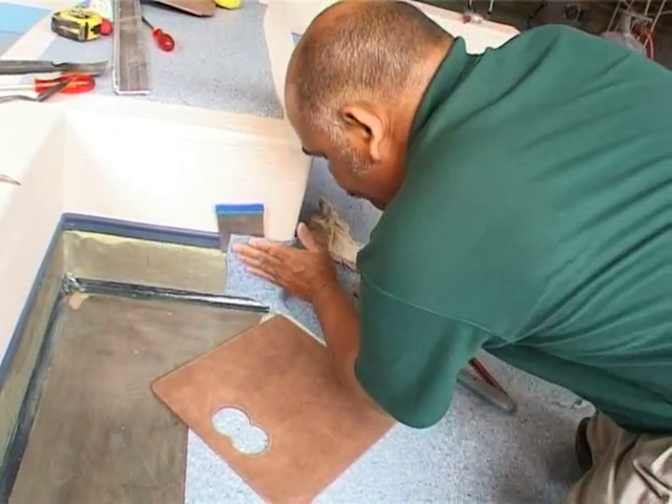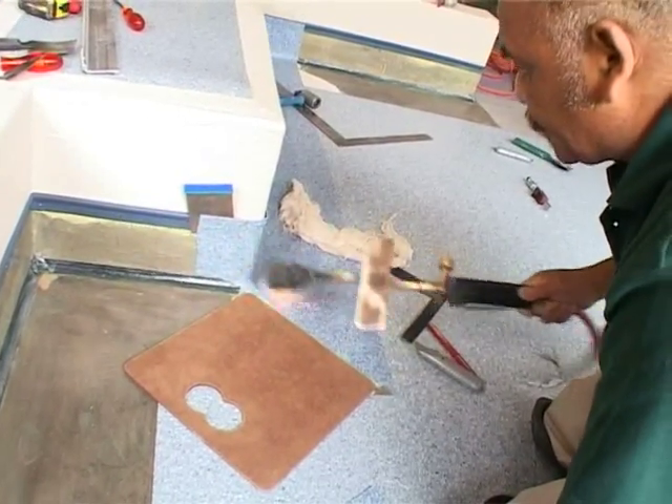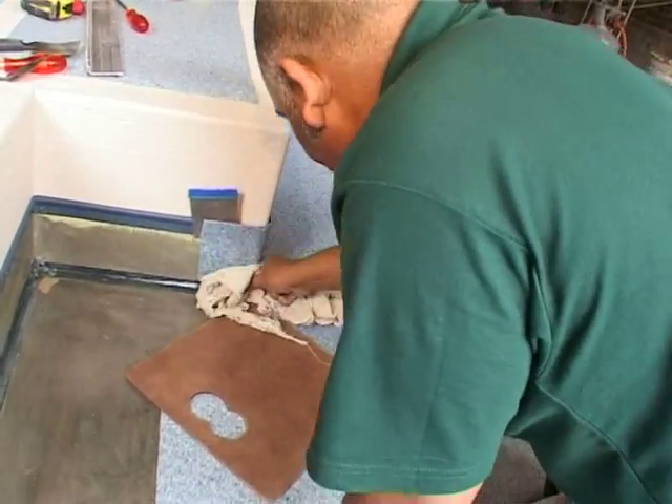The start of the butterfly angle weld is usually started on the wall, coming down to just a twist off the corner, to ensure that the sheet does not join on the corner specifically.